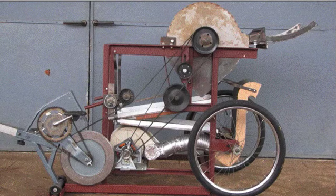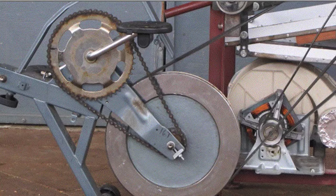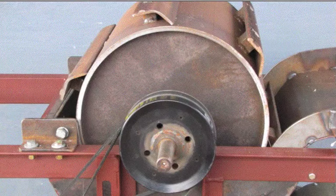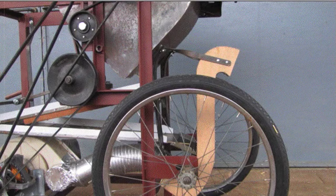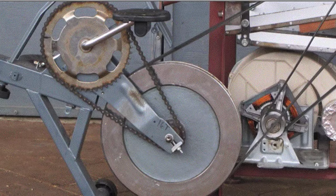The rider pedals an adapted exercise bike, which, through the first chain gearing, converts a 60 RPM crank speed to a flywheel pace of 195 RPMs. That 12-inch flywheel drives a serpentine belt to a 6-inch pulley, which doubles the RPMs to about 400. The threshing drum spins at that rate, and the secondary drive to the screen oscillator maintains that 400 RPMs. The adapted dryer fan has a much smaller pulley, which brings the RPMs to 1600, which is needed for the proper airflow to the winnowing tower.